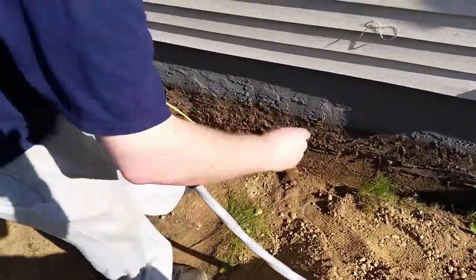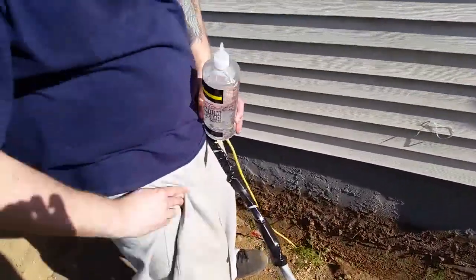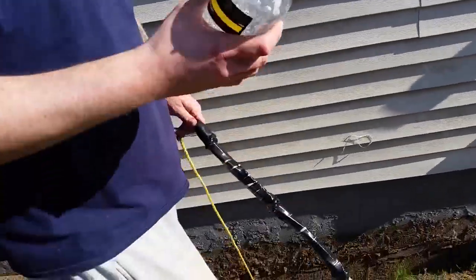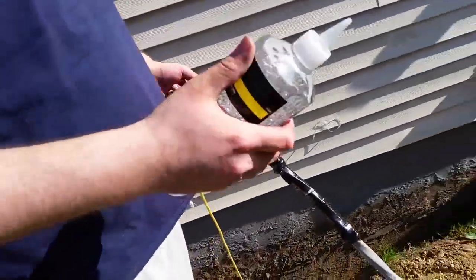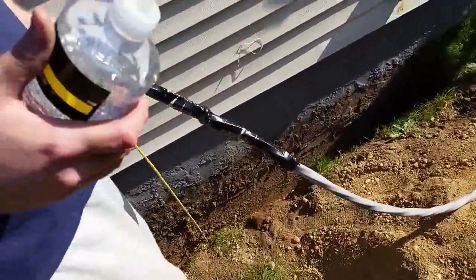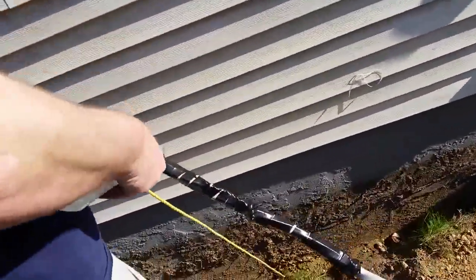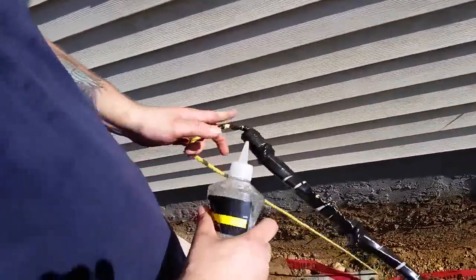So now we're gonna put some pulling soap. You get this from Home Depot or Lowe's. And this soap is very good for pulling wire this thick through. But you're not gonna get wire like that. Klein Tools makes this. It's a premium synthetic. You just want soap, and you lube that everywhere.